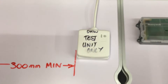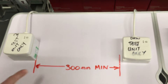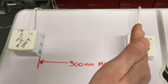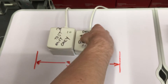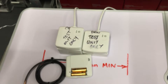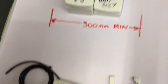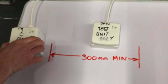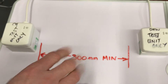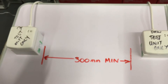Another important thing to check is that the receivers must be a minimum of 300 millimeters away from each other. If you've got them installed too close together, they are not going to work. The CS92A and the BDR91s must all be spaced a minimum of 300 millimeters away from each other, and also 300 millimeters away from metallic objects, cylinders, and copper pipe.